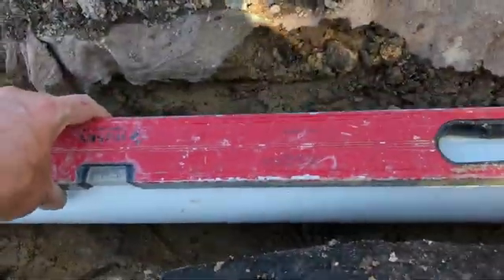So that spider just went for a really fun ride. Now all this is just going to build up and overflow, then cut back into the drain. This is how it works: after all the water comes down, it builds up, comes through the saw cracks, and goes right into the drain. In my state I cannot just bore straight through — I had to bore through the concrete instead of breaking it and running the pipe all the way through. But this is exactly how it's supposed to work — water comes out, drains away. This is how you prevent your backyard and patio from flooding with catch basins. As always, like, share, comment, subscribe, and until the next one.